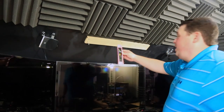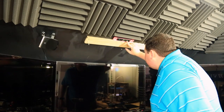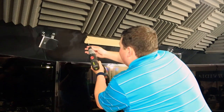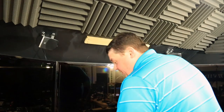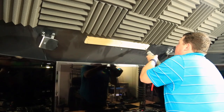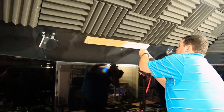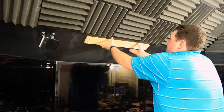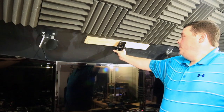I had to borrow my wife's level from the tomboy tools kit because I couldn't find either of mine. I own like two of them but I can never find anything in this house. Let me put it up there and make sure it's good and level — it is. I already leveled it before I turned on the camera. So we can go ahead and drive this one home. Alright guys, moment of truth. If I measured correctly — 24 inches between there and there — these two screws should both grab a stud and pull tight into the wall. What do you know? Looks like I know what I'm doing. Now you can see that board is solid, and that's exactly what we want. We don't have to run the bracket right into the sheetrock — we can mount it right there.